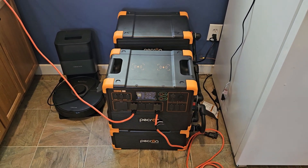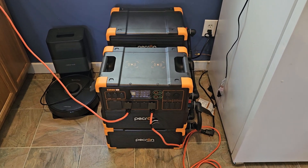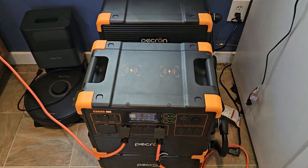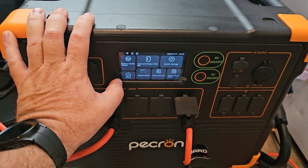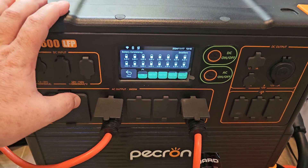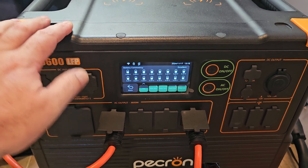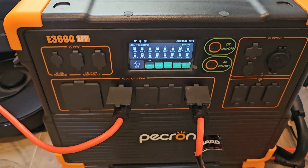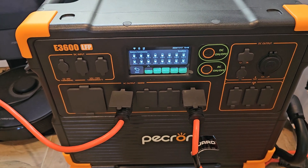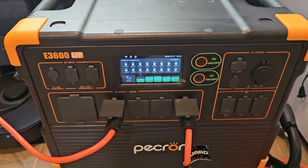I was intending to do the test all the way through until Friday. But Thursday night, I discovered the main battery pack had gotten down to 17%, and I really didn't want to get it anywhere below that, because I'm planning on using this for a long time. The fewer cycles I can do, the longer it's going to last. I know it's rated for 3600 cycles, and a cycle is down to 20%, so they say.